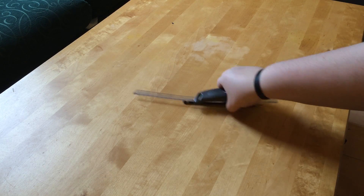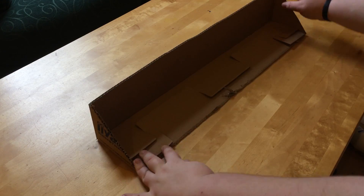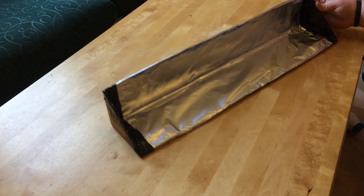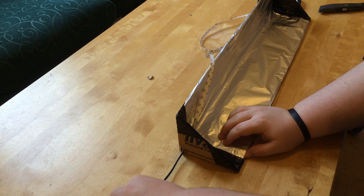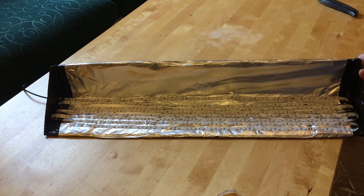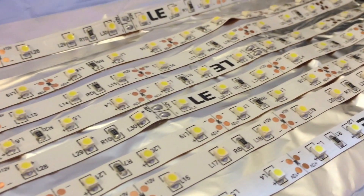Assembly is mostly cut and stick. Start by measuring and cutting off your box. Now line the inside of the box with tinfoil, making sure the frosted side is facing up. Once secure, cut a small hole in the corner for your LED power cord. Then pack the LEDs in as tight as you can, making sure none of the contacts are touching the foil.